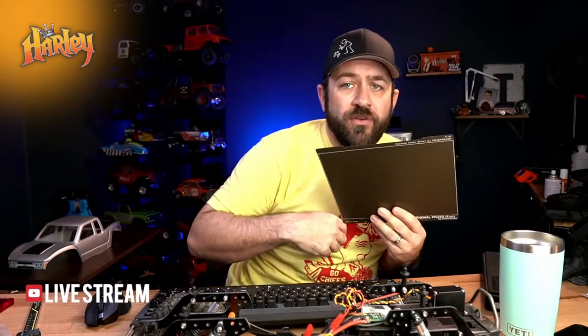Yeah. Apologize if you've already said, but are you printing this in PETG or PLA? Also, when you print PETG on your Prusa, do you use the smooth or textured build? Most of the structural things that I've been printing, I've even been using PETG on my Prusa. When I'm printing PETG, I use the textured bed. I was printing PETG last night, so that's the textured bed. And I've been using a little bit of glue stick when I've been using the textured bed. And I use the Prusament black PETG. It's what I've been using on the class one for structural parts as well. So yeah, and 3 hours to print that.